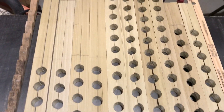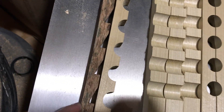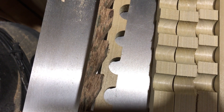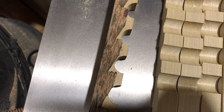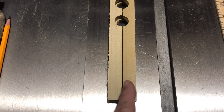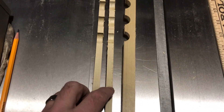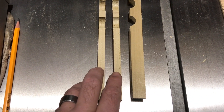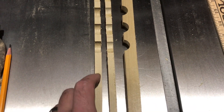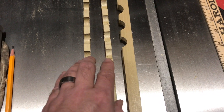That part's done — just a few hundred holes or so drilled. Real quick, so you can see the difference in the manufacturing process here: after they're split this way, I turn them over on their backs and split them this way. So I've got a little more than a quarter inch here, and that's really all you need for shelves in a kitchen cabinet. If I were going to do storage shelves in the garage, I'd use the full three-quarter, but all you need is half of that three-quarter cut, and you put them in the cabinet.